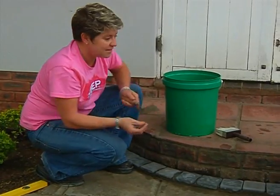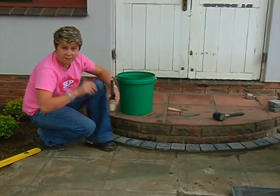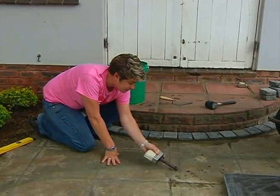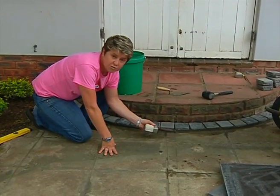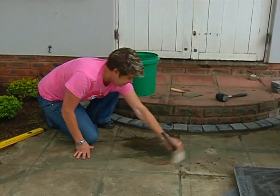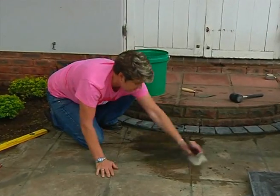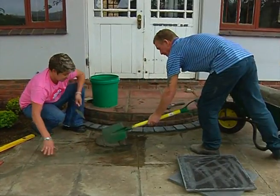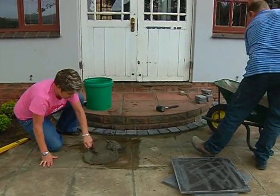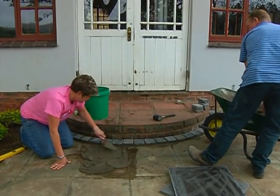Okay, Garth, let's start. First up, what we've got to do is make sure we remember where our line is. There it is. That's the all-important part where we're going to work off that way and off this way. Remember to wet the surface first. Then throw down some concrete mix. Level it out a bit with a trowel, and then you're all set to start laying down the tiles.